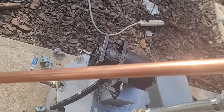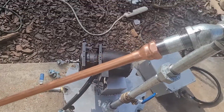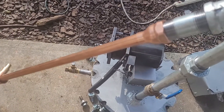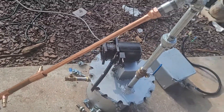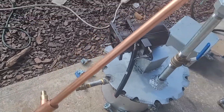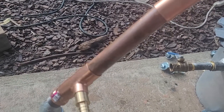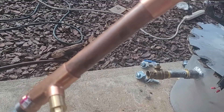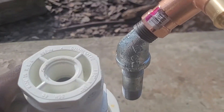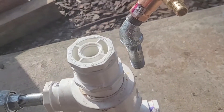In this outer column, these two inlet ports are for ice cold water to pump in and come out. The ice cold water is going to pump in, cover the whole inner pipe, and make it ice cold — which will then cool down the gases exponentially. Copper is the second best heat conductor on earth, so it will very quickly conduct that cold and since the water is constantly being pumped, it's going to work amazingly. Hopefully this condenses something like 90% of the oils, depending on the plastic. They're going to come down and feed into the filtering system.